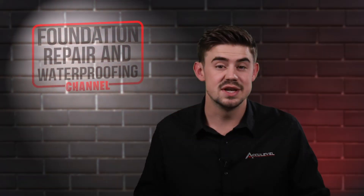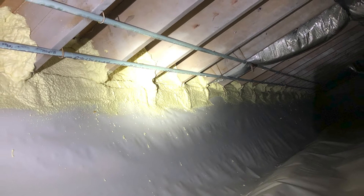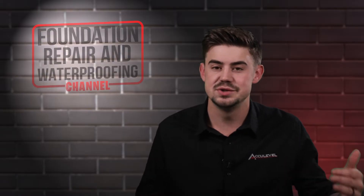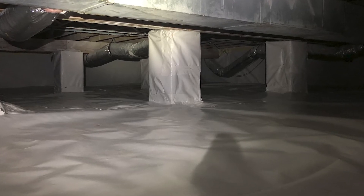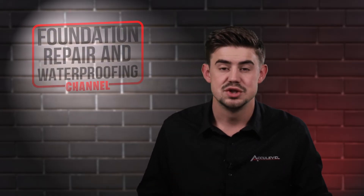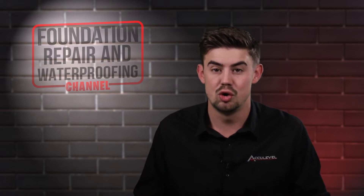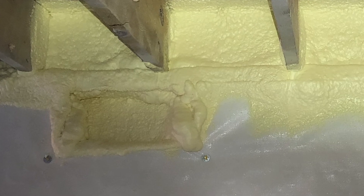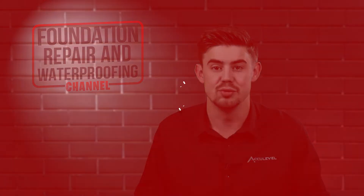The best solution is a full encapsulation in your home with a closed cell spray foam around your band board all the way around the crawl space or the basement. You may think: why encapsulation? I thought that was for moisture. Yes, it is — but it also prevents and keeps a complete seal on that crawl space so you're not letting cold air into your home. You're able to close up that whole space with spray foam, close out those vents, but still condition the space appropriately to not create more problems down the road.